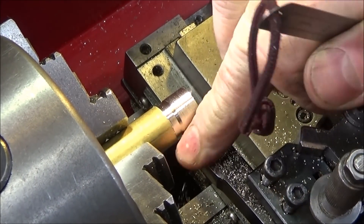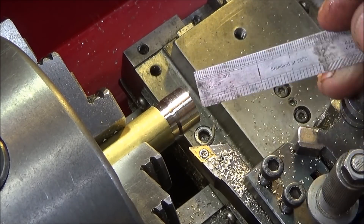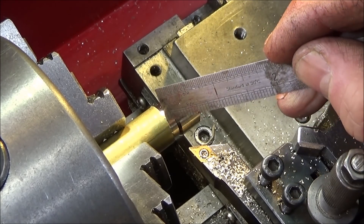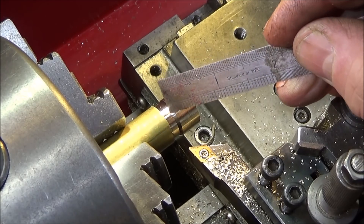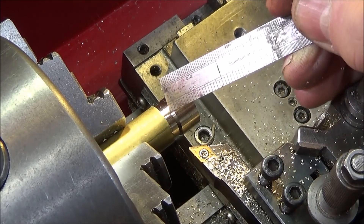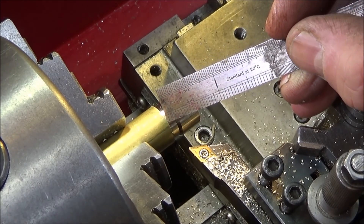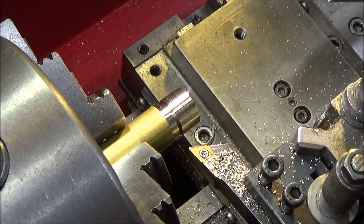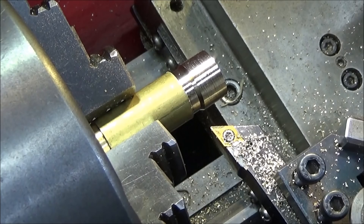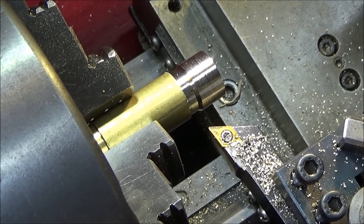As you can see in that example, the tool can be used for facing off, turning, and then plunging straight in at the back as if doing a thread undercut. You can also face down the shoulder, turn backwards towards the tailstock, and use this tool for shallow decorative grooves.